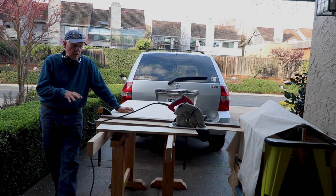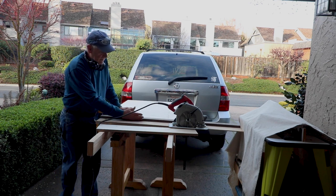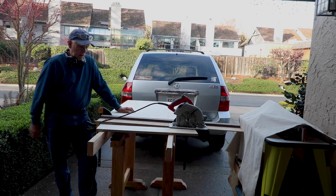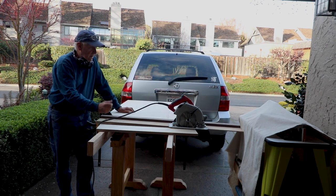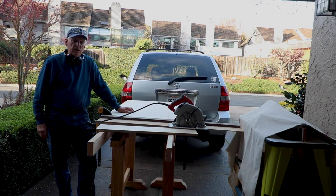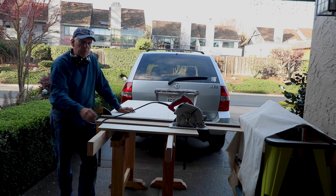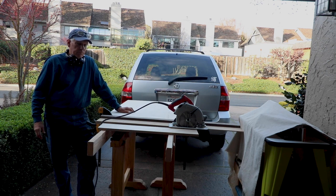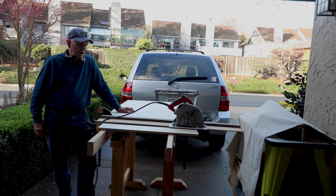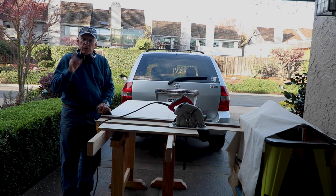I have my corded powerful circular saw and a perfectly straight edge. I cut with my circular saw using a track made from one-quarter inch MDF and a piece of walnut, making a 48-inch circular saw track for cross-cutting. I have two different tracks — both designed on one side for my corded saw, which I usually use for breakdowns, and the other side for my Ryobi cordless, but it bogs down and runs out of power, so I tend to use the corded saw.